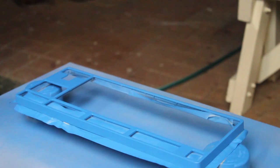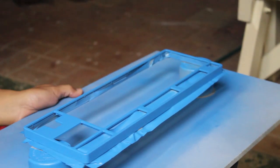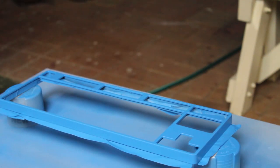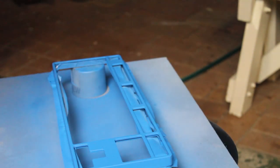What this does allow is the spray to be dry and not wet, so the additional layers don't keep compounding as wet paint. Allowing the paint to dry for too long, however, will allow the paint to harden up and cure and kind of close off, and the paint will find it harder to grab onto the previous coating. Having it still in the drying process will allow the paint to merge like wet liquids do.